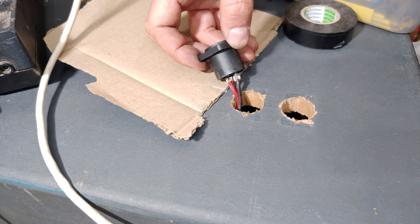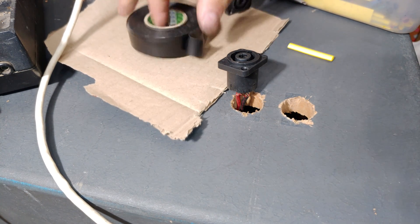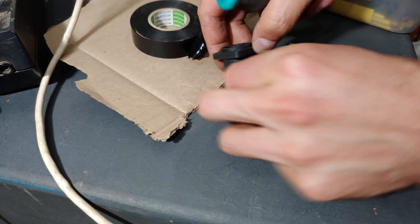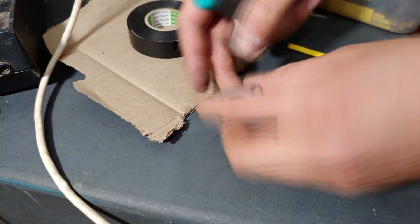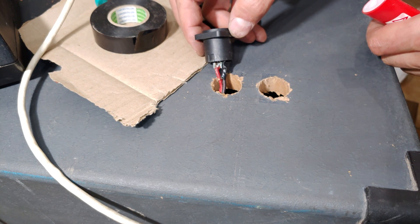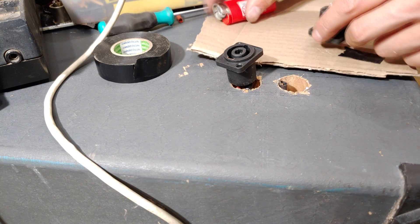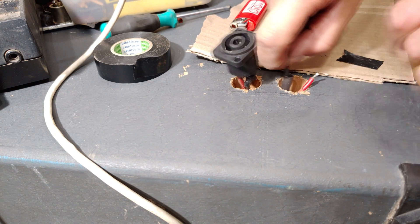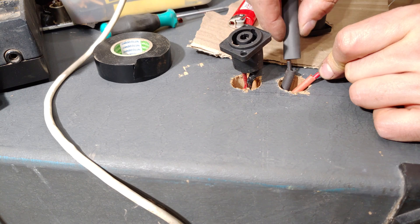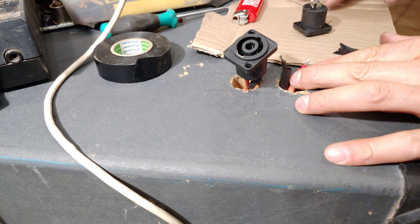It's soldered, and if you want to do it like a pro you can add heat shrink. I'll show you two methods: one is just tape if you haven't got heat shrink — take some tape and just separate the wires in case one comes loose. There, I've put the tape; that's the method if you haven't got heat shrink. On the other side I have heat shrink and a lighter, and I'll show you how to use heat shrink. Heat shrink is a product that when you put it over the conductor and heat it up, it shrinks — as the name implies.